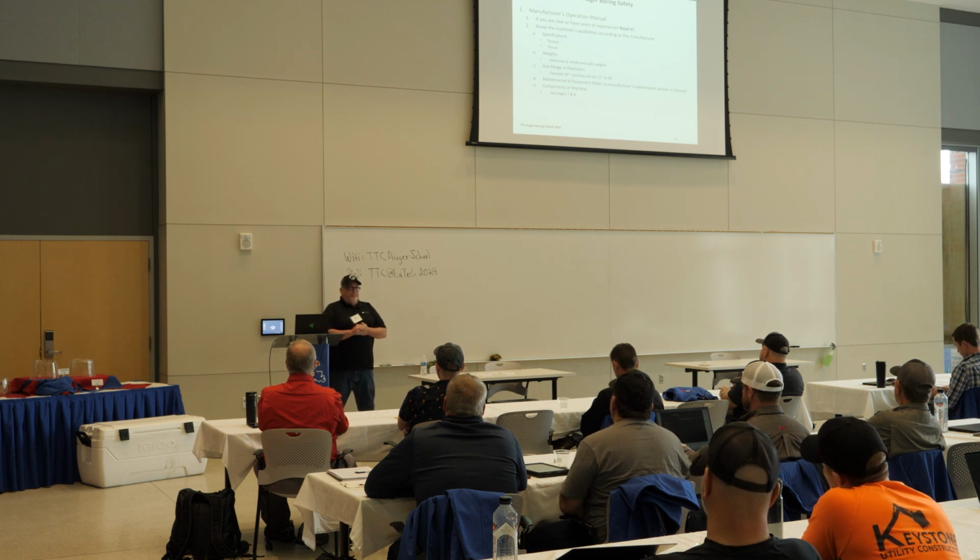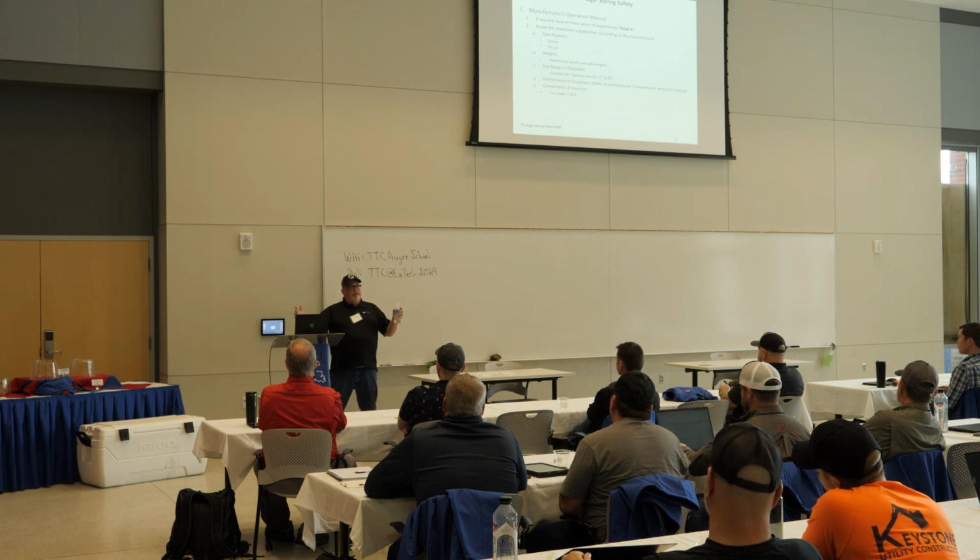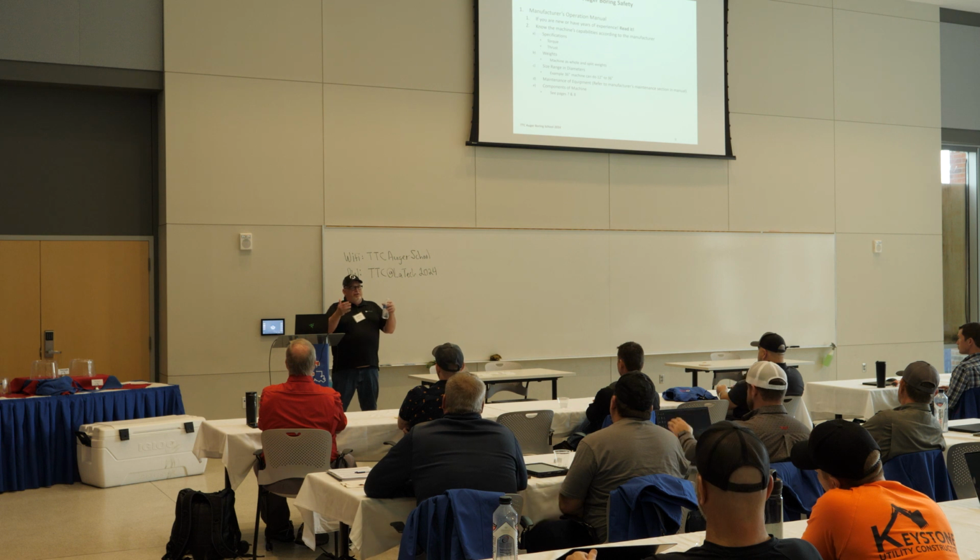We have a customer up in Canada now. When they clean out the base, they put a hammer on the front, and they use our airway augers, and they pump air, and it breaks up everything that's wedged inside, and then they clean them out. And I tell people, if you have to do this, just do 10 foot at a time. Don't put a whole 20 foot stick of auger and try to bring that casing, because you got a floppy joint out there that's outside of the casing. Just do 10 foot at a time so you're a little more stable.